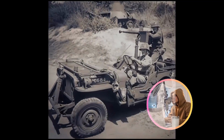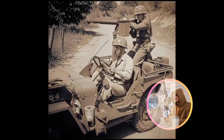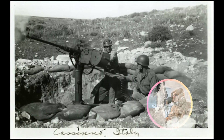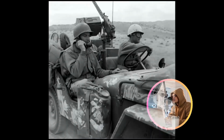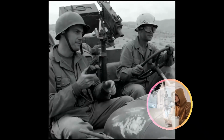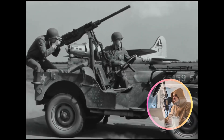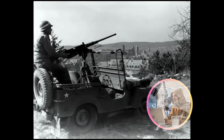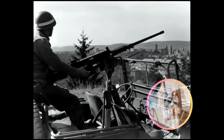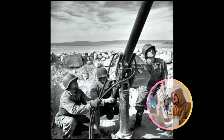In contrast, Cupp's innovative spring-based mount effectively absorbed approximately 40% of this destructive recoil energy. This absorption occurred through the cyclical compression and expansion of the springs, with the energy transforming into heat within the spring metal rather than being reflected back into the weapon. This phenomenon is scientifically termed hysteretic damping, a principle fundamental to the superior ride quality provided by automotive suspension systems.